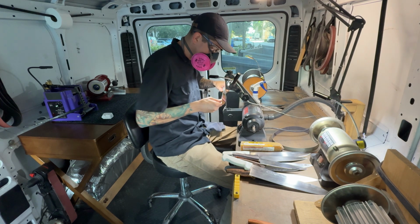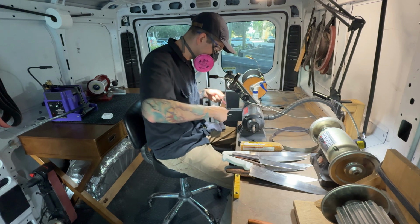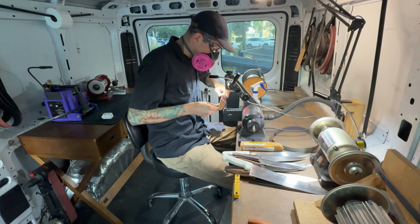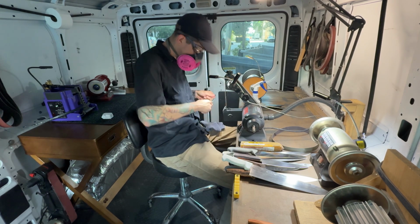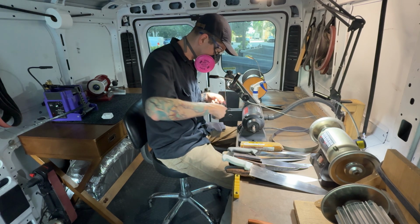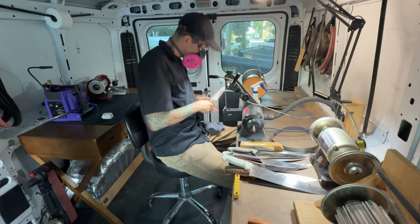There's a few different characteristics of the burr that you start to recognize. When there's a little chip, it's pretty easy to tell. There's a little gap in the burr, and there may be a little spot where the light is not reflecting back at you like it should.